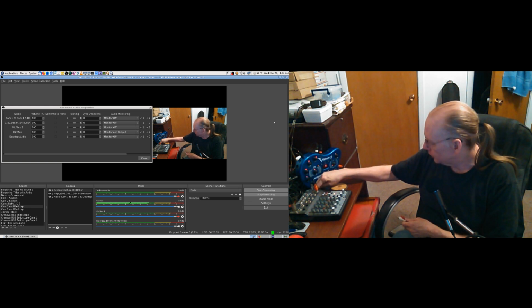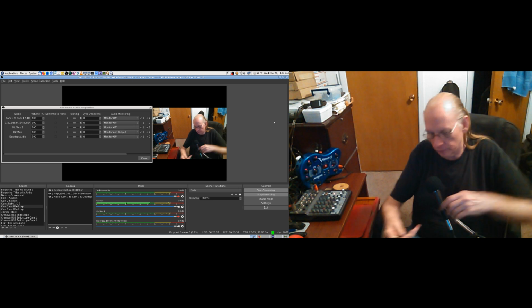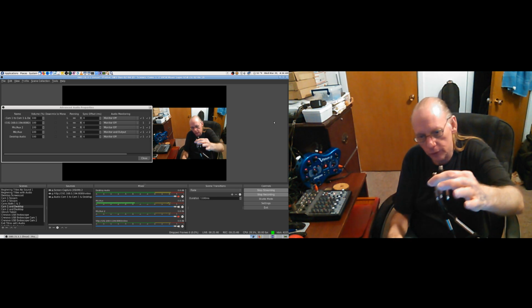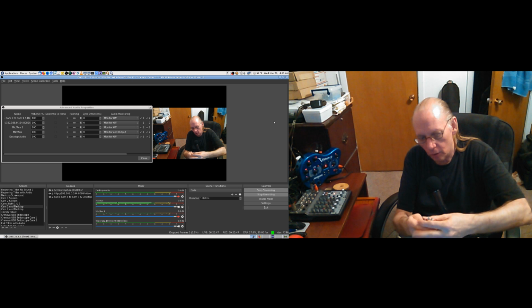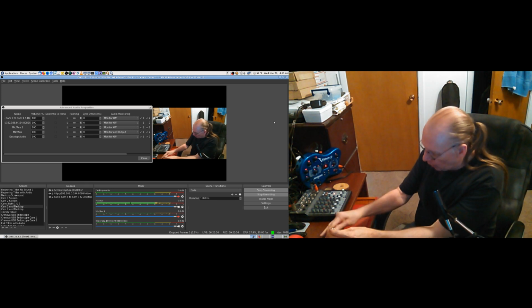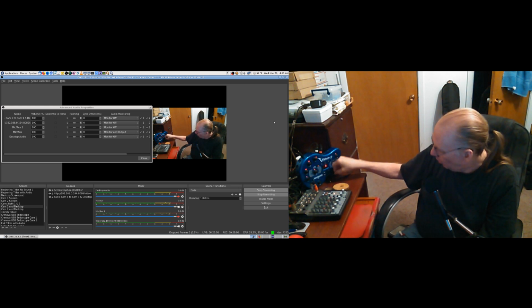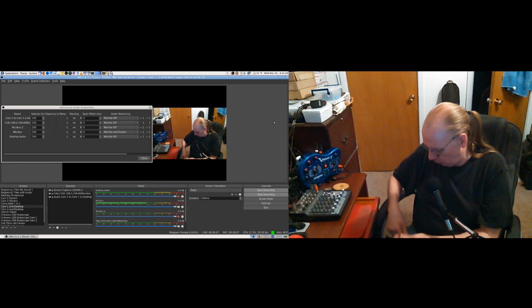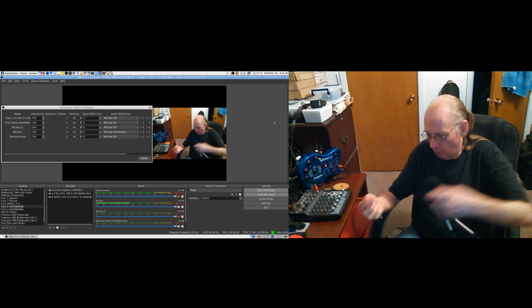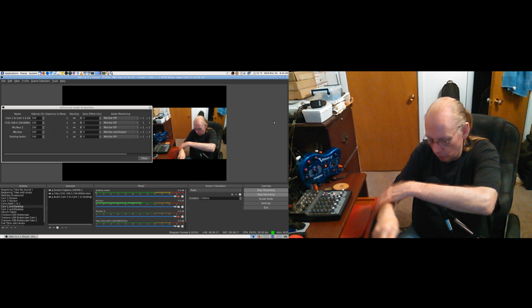I have some. Actually, I checked through all my... I had 6 of these RCA female to quarter-inch adapters that is right here that I'd been using from different times. One set is taller than the other, and I kept testing around, and I figured out that one of the taller ones had an intermittent connection that would make static and just quit working when you'd wiggle it. So I took it out of the mix. I usually don't throw stuff like that away. I usually save things. Well, if I think I could fix it, I'll save it to fix it.